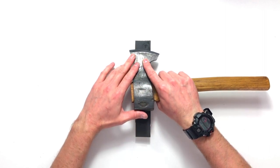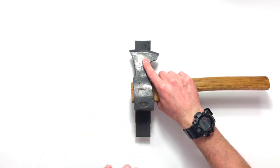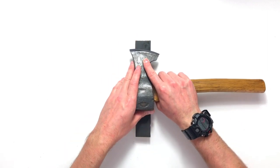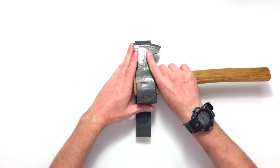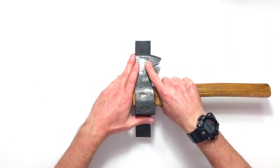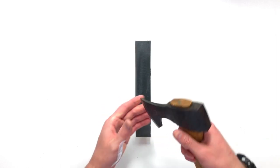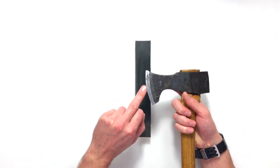That there is me resting on that bevel. From here I'm going to draw that axe back in a smooth motion but I'm not going to adjust, twist, or lift or lower the handle — I'm pulling straight back. Rest down, find that bevel, pull straight back. Then I'll turn it round and have a look to see if I've scratched that bevel.